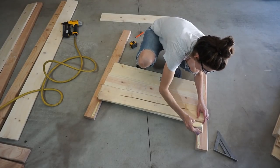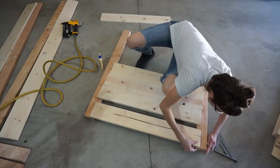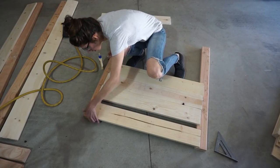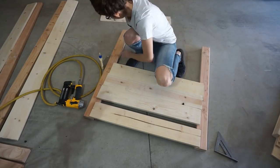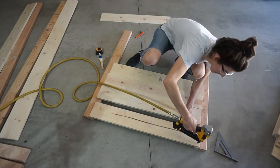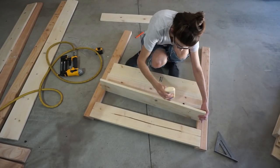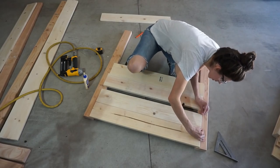So I'm taking my wood glue and I'm gonna start working each board at a time. I apply the bead of glue, make sure everything's lined up where that mark is that I put on the 2x4s, and then I will nail it down. If you don't have a nail gun, you can screw them down, or you could hammer them in by hand if you like. I will list all my tools in the description box below in case you're interested in the exact ones that I use, but this nail gun, I've had it for a couple years and I use it for various different projects around the house, and it's been a great investment for me.